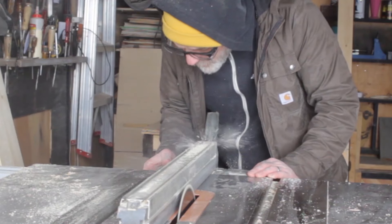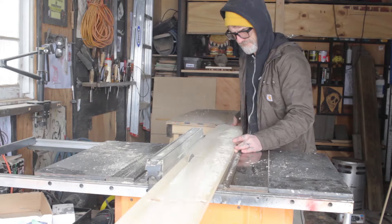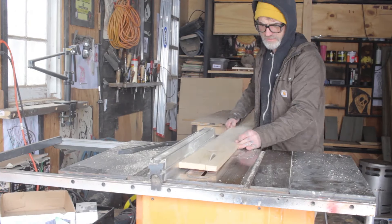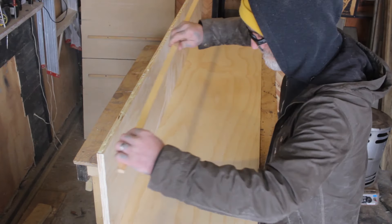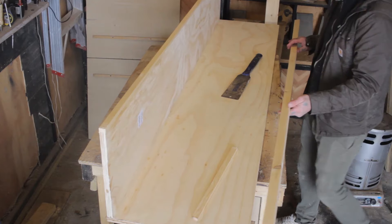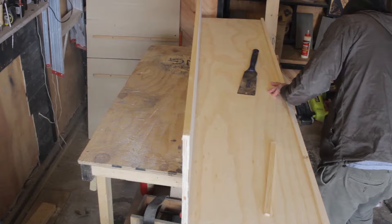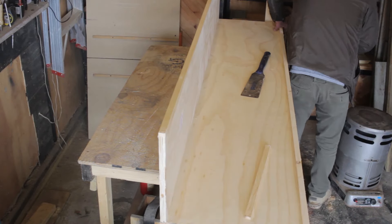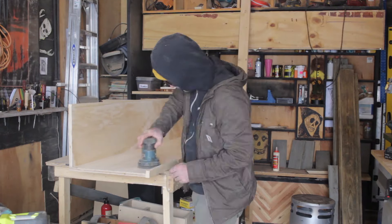Like always, I pre-drilled and screwed some boards together. The basic idea is it's going to be a very long cabinet that can fit about five or six sets of records. That edge board on top hides the seams of the plywood. I glued and nailed a board onto the front with a little lip along the bottom so the records can lean against the back and hit that lip so they won't fall out — but that board is going to have to get removed.